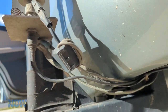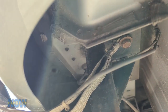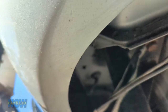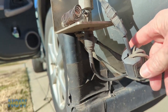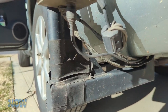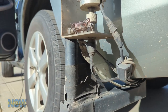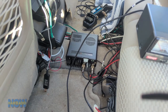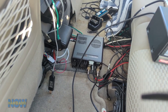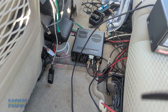Let's see what things look like deep underneath. The coax has been out there in the weather for 17 years in some pretty harsh conditions — I don't see any cracking. This choke is part of what Tar Heel supplies to keep RF from going back to the control system. The hypothesis then is that RF is somehow getting into the radio and causing it to shut down at that specific frequency.